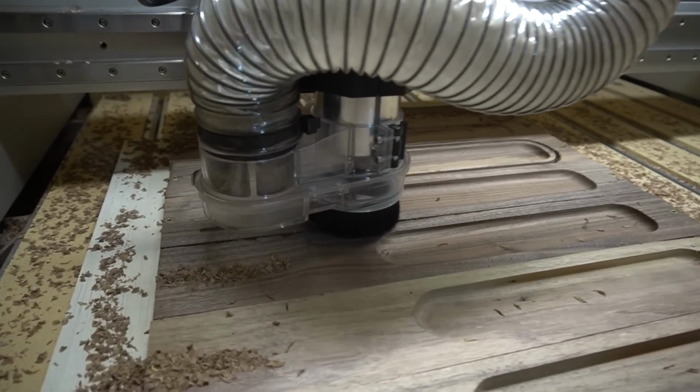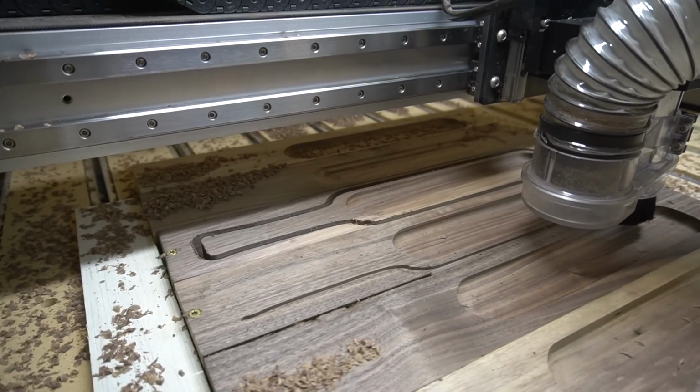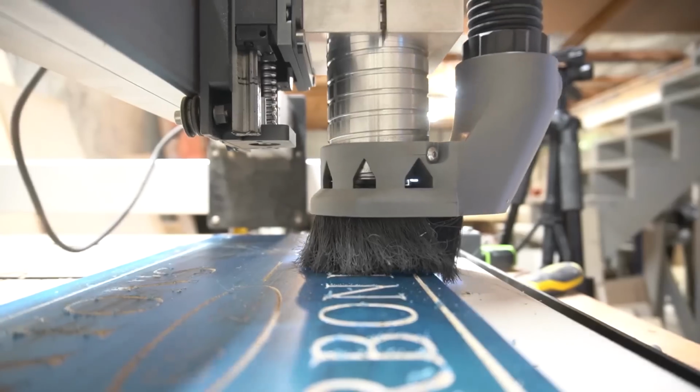So now let's quickly jump into CAM. CAM is computer-aided manufacturing. CAM is what generates the G-code which your CNC reads to cut out your design. This is where toolpaths and feeds and speeds come in. The really cool thing that's often overlooked with desktop CNCs is most manufacturers have developed their own software that goes with their CNC. And they've combined both CAD and CAM software together to make one. So you actually design and do the toolpaths. So you'll do the CAD and then the CAM in the software, and then it generates a file that your CNC can read and make your design.